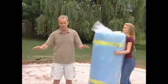If you've decided to use sand for the bottom, now is a good point to bring it in. Otherwise, you'll be hoisting it over the pool walls. You'll want to cover the area to a depth of about 2 inches or 5 centimeters, but keep it away from the base rails until the walls are up. Otherwise, you'll clog them with sand.